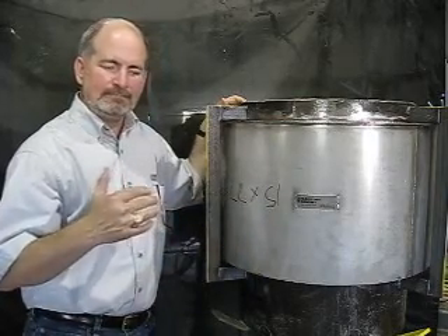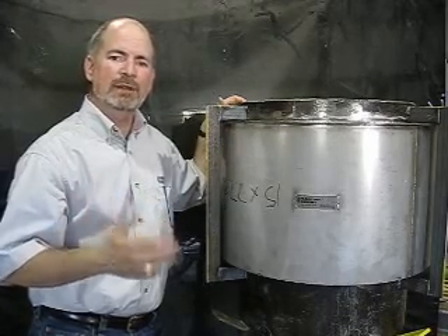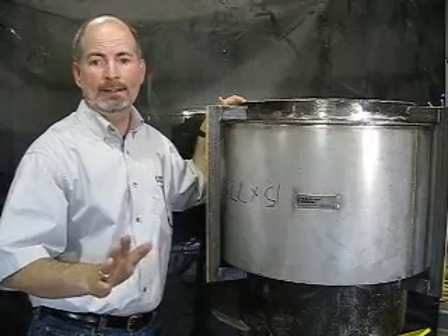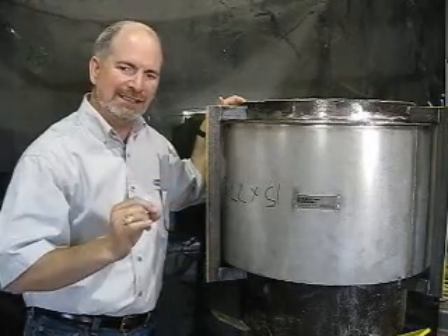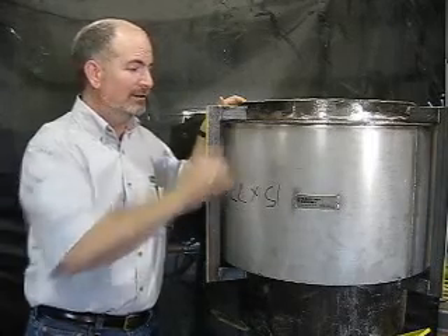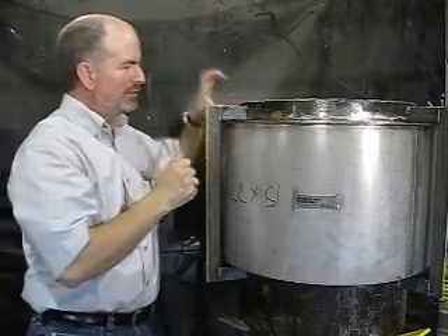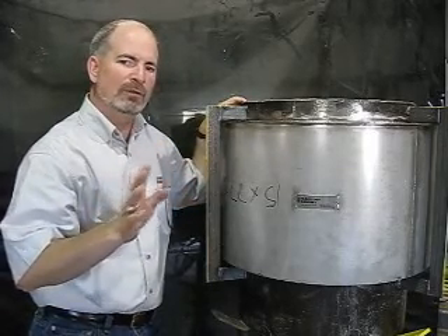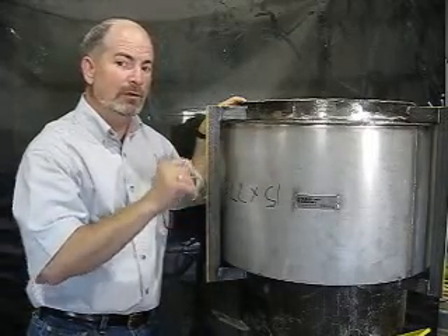These original ones are all stainless steel. A lot of people will say they want to upgrade to Inconel 625 — and Inconel 625 is a great material. If you want to do that and pay the extra money, go ahead; I would encourage you to do that. If you want to be able to test a bellows to confirm sound integrity, then you might want to go with a 2-ply testable bellows. We'll put an external port on it, so when you're inside there you just hook up to that port, put a little pressure in there, and read a gauge. You're holding pressure — and I'll have more to say in some articles and videos on testing 2-ply testable bellows, so look those up to make sure you don't go too high in pressure.